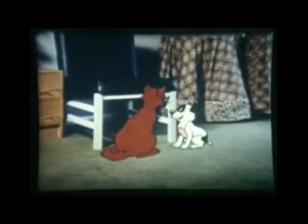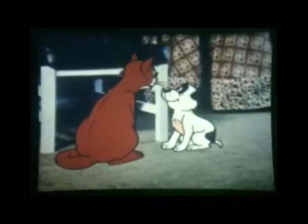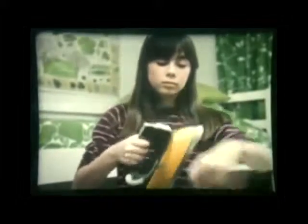It's a good idea to check the flex of an appliance every time you use it. And get it replaced at once if there's anything wrong? You're beginning to catch on. Mind you, damage to flexes is often caused by people who don't stop to think what they're doing. Flexes are made to conduct electricity, not to stand up to very high temperatures. And they're certainly not meant to be used in a tug of war.